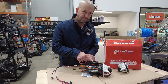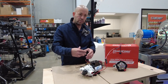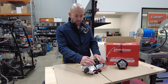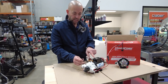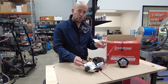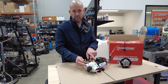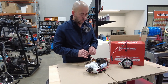We've connected the Everflow pump to a 12 volt supply. I wanted to show you how to get through your day if you do have a fault. The leak detection solution over the probe will complete the circuit and turn the red light on after a couple of seconds. If we run the circuit with the plug disconnected we'll get the red light on after a few seconds - that's the same indication as when we get fluid over the two prongs in the cartridge assembly. Moisture in the plug assembly can also cause a similar effect, so keeping it clean and assembling it with some commercial grade vaseline to keep water out of the socket can also assist.